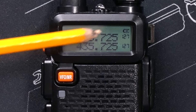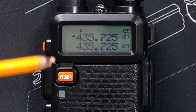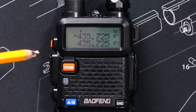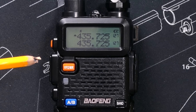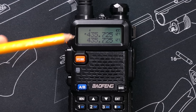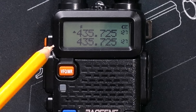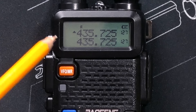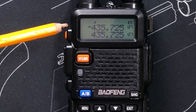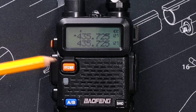You will also notice on the screen two lines. There are two lines because the Baofeng UV-5R can listen to two frequencies or two channels at the same time. You can disable this option in the menu to hear only one channel at a time, but no matter what, you will always see two frequencies or channels listed on the display. A little triangle or cursor on one of the two channels indicates the selected channel — meaning if you were to press the push-to-talk button, that is the frequency the radio would be transmitting on.